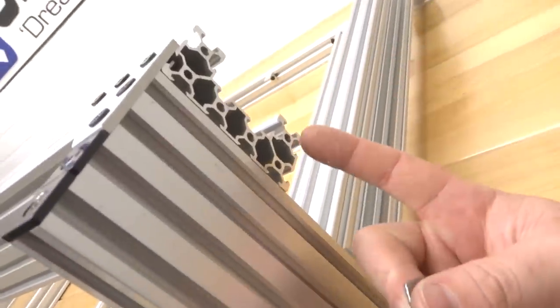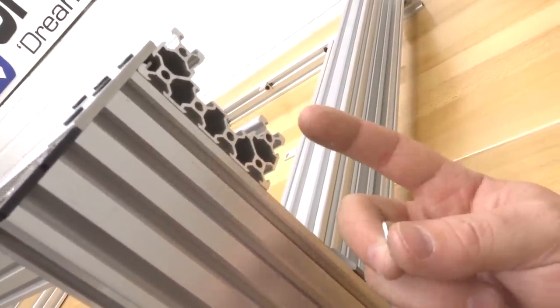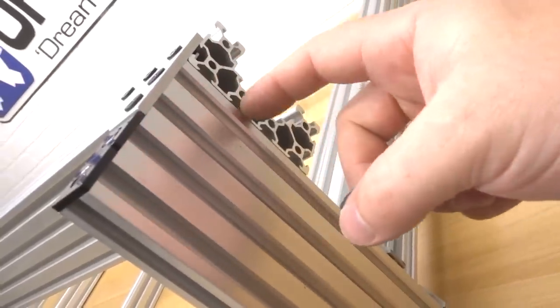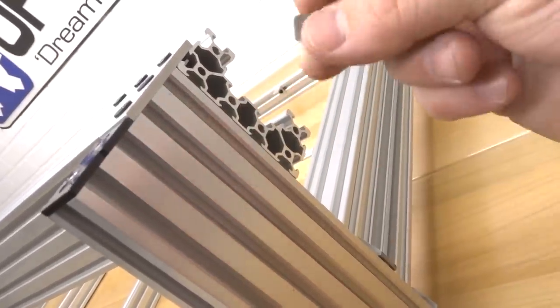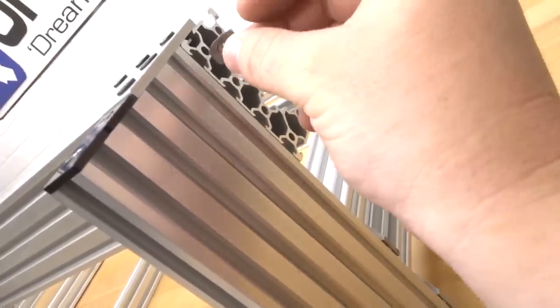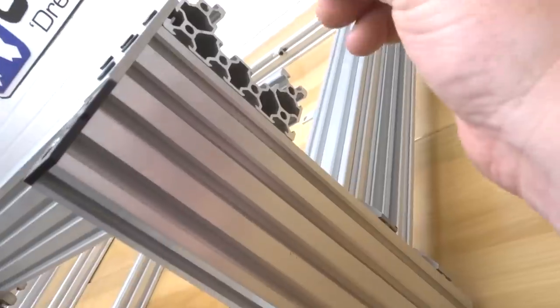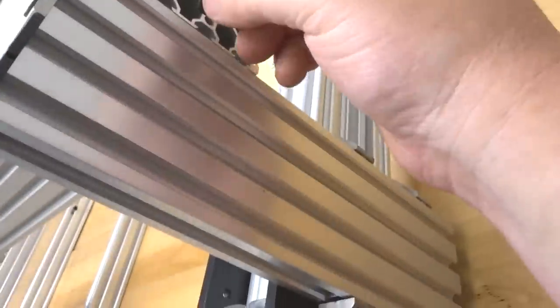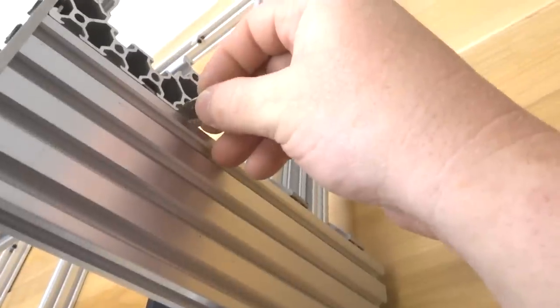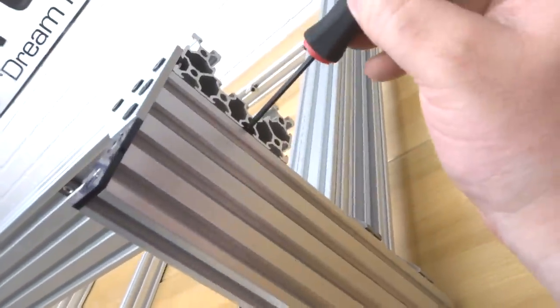As you can see, I haven't capped this with a C-beam end mount, so it's not an actuator yet with our lead screw. So we have open slots here. And I did that on purpose so we could insert these T-nuts and strengthen the system. So let's go ahead and put T-nuts in the first track here. Grab another T-nut and insert it into the second track and the third track and the fourth track. If you need to push those through, you can use your ball driver.